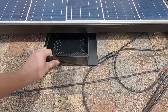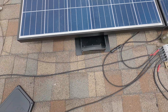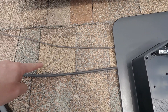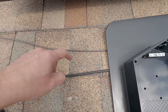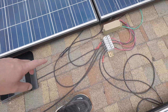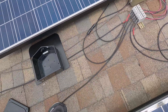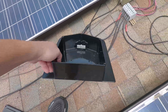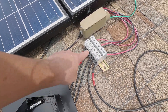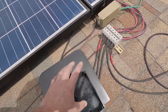I'll have to look at the instructions again, but I think you have to cut out a portion of your shingles right up here, and then this kind of slips underneath it. Wherever that lines up in relation to my penetration right here, that's basically where it's going to go. I got the thicker box so I can use these Dinkle connections right here.